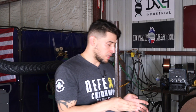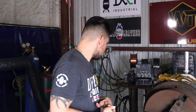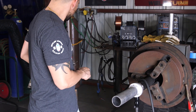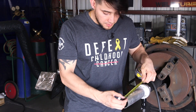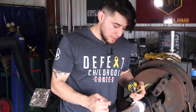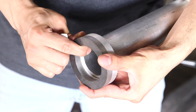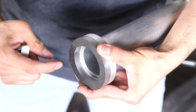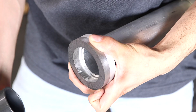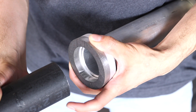As we move over here, you can see we have a metal transitioner already piped up to the pipes, ready to be welded out. But first let me explain how you'd go about tacking or fitting it properly. This is the aluminum side right here. What you're going to want to do is measure about three-eighths of an inch from the edge of the pipe, make a line — whether with a soapstone, pencil, or marker. Get your transitioner, use the proper side, and slide it up to that line. The reason you measure three-eighths is so that when you put the other dissimilar metal on, you don't want those metals touching — you want to leave a gap in between.